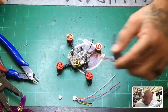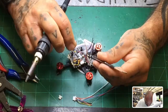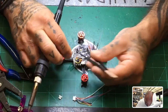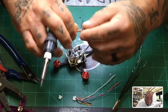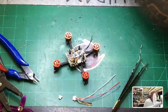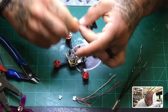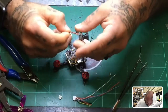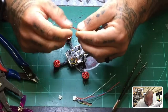Three of these wires are going up front and one is going to the back. Let's lay the camera right here, grab my tweezers and get going. We're going to start from the farthest away, which is going to be ground. The blue wire is going to go to the VTX, so I'm going to wind these three together since they're staying next to each other. You need to be gentle with these wires — hold the base when twisting so it doesn't kink against the board.